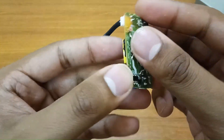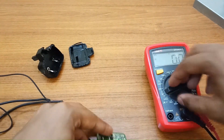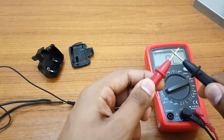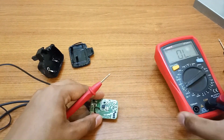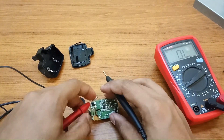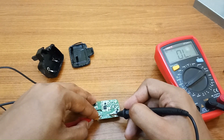On the other hand, there is a fusible resistor — I have to check it. I guess this one is also open. Set the multimeter to continuity mode — it will produce a beep sound on short. As you can see, it is not giving any reading.